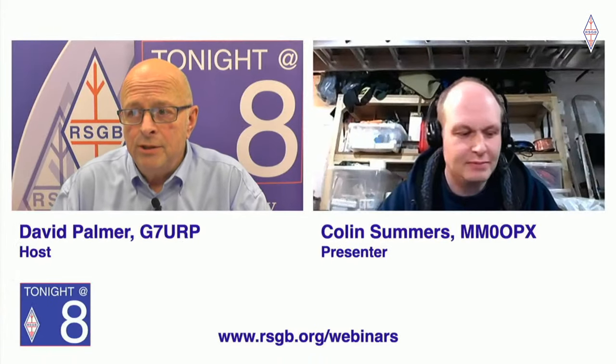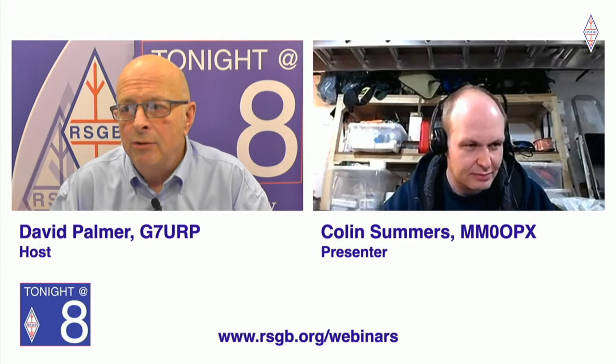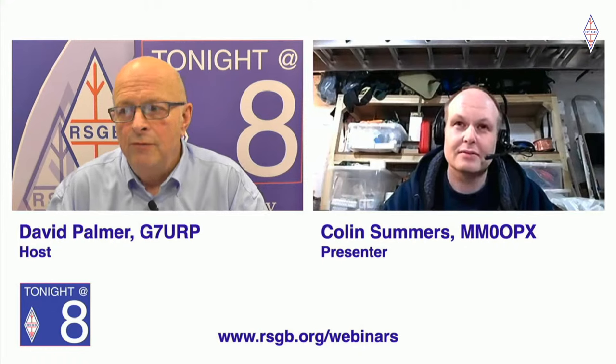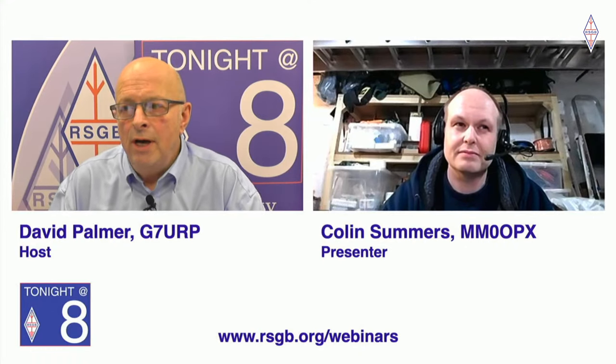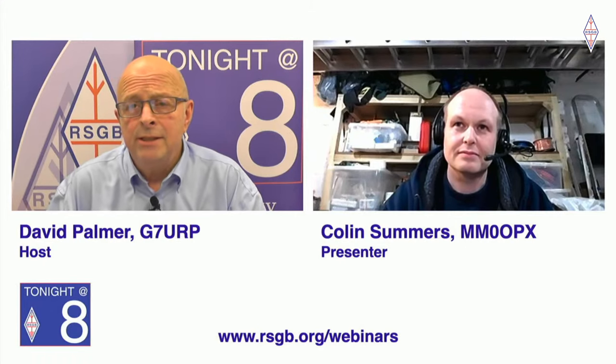Paul Temple has asked a question. Any tips for keeping the SWR dip mid-band across 40 metres to 10 metres? When I cut for the phone segment on 40 metres, I get dips on higher bands moving progressively away from mid, even with a capacitor, he says.